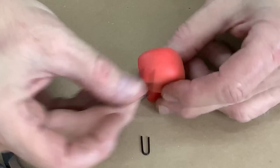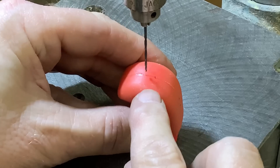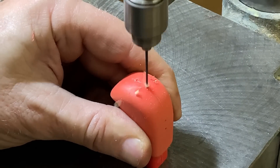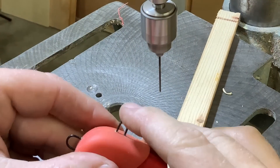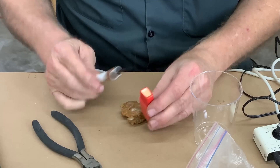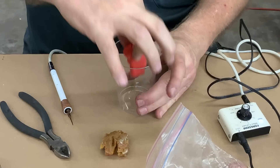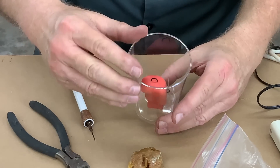Now we're ready to drill some holes. You can see I made tiny little marks where the holes go — right there and there. We have two different sizes of hangers, and hopefully I'll be able to drill these with some accuracy. There are our hangers all potted in and ready to go in the mold. I broke out the sticky wax — the ever-popular sticky wax from freemanwax.com. Getting it nice and hot and sticky, then just pop the piece straight into the bottom of the cup. No funnels, no sprue, no vents — just a single shot deal.